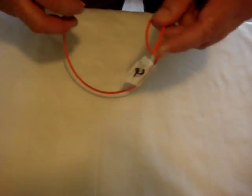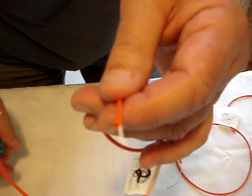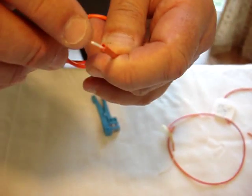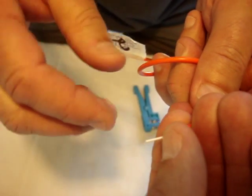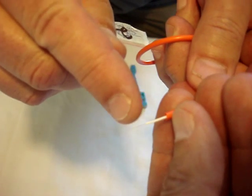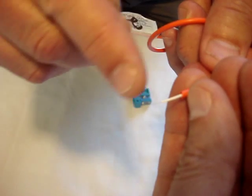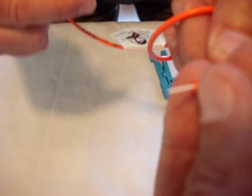Let's go to the second step. We're going to cut this down. What we've done here is cut off the aramid — there's no aramid now. We have exactly about one centimeter, and this is about two to three centimeters total. You can see the fiber exposed there — it's there.